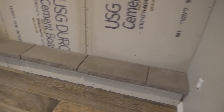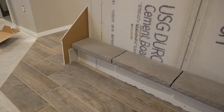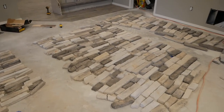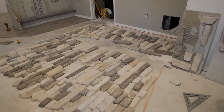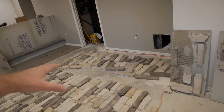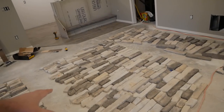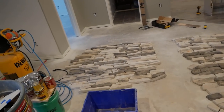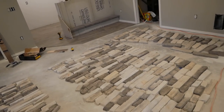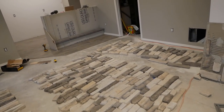All the panels are dry fit into place to make sure everything's going to fit. One other very important step is to lay out the veneer in your area. If you have enough area, it's good to lay the thicker pieces in one area, the medium thick pieces in another, and then these smaller pieces in another. That's going to help you find the pieces that you need and not be searching through a bunch of piles